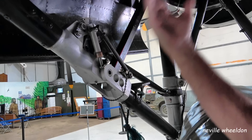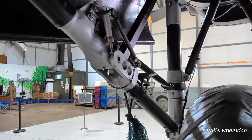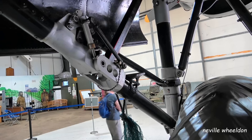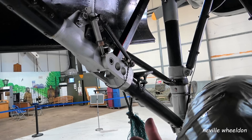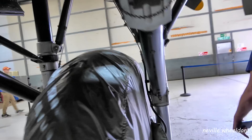In order to break the geometric lock to get the undercarriage to retract, that unlocking jack unlocks the geometric lock and enables it to break, fold up and get the gear up. Every single aircraft flying has an undercarriage with oleos and a stay or radius arm. Even an F-18 and an F-35 have a radius arm or stay with a geometric lock to provide rigidity on the ground, but you don't need it when flying. The British call it undercarriage; the Americans call it landing gear.